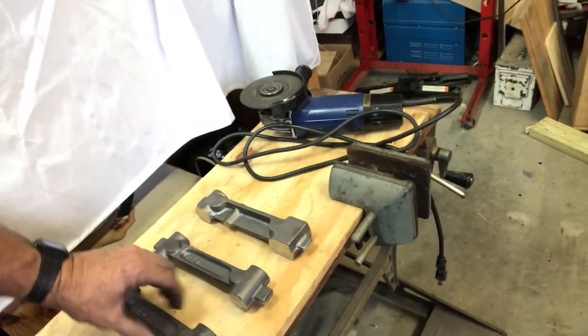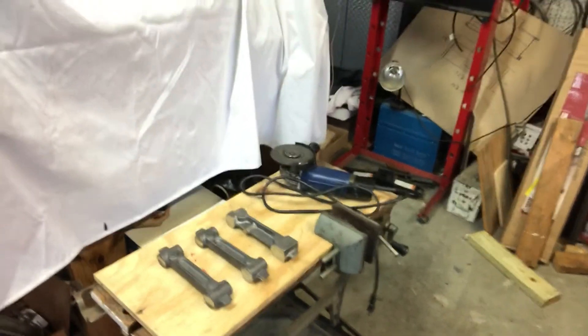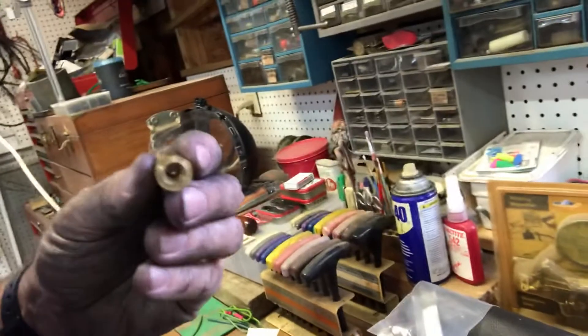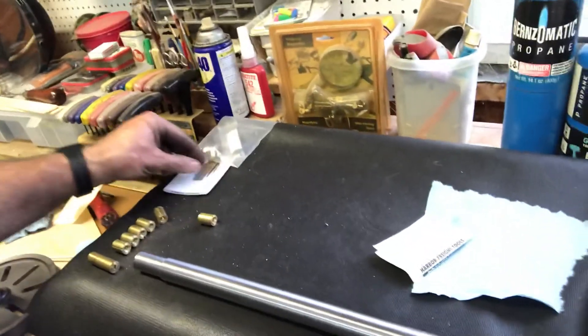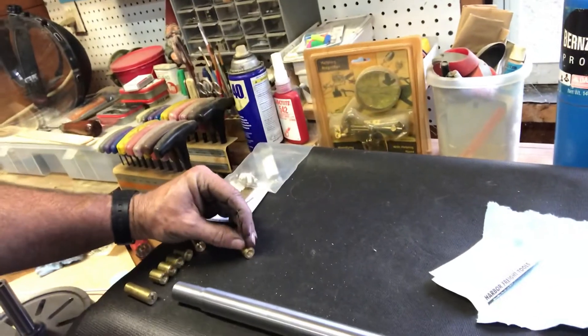Now I'll be able to set each of these pieces in the vise and mill flat on one side, then rotate it over and mill off the other side. Then I'll have some consistent surfaces that I can measure from and do the actual machining. Here are the clamping pads I was talking about — they're half-inch brass with a quarter-inch 20 bore and tap in the center, and a one-sixteenth-inch slot milled into them. The one-sixteenth-inch pin — I'm going to use drill rod — will come down through the casting and create a little finger that'll hold it in place and keep it from rotating. Thanks again everybody, I appreciate you watching. I will keep you posted — I hope you enjoyed it.